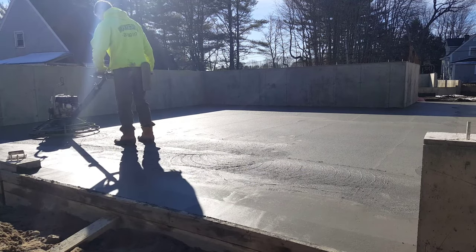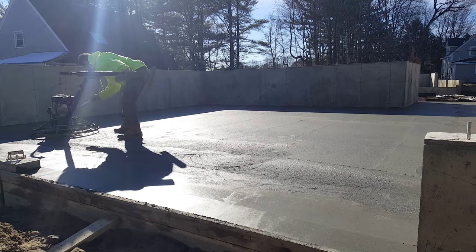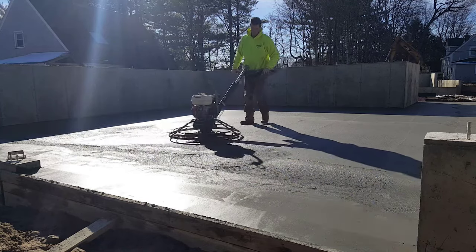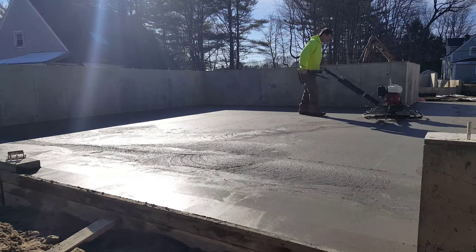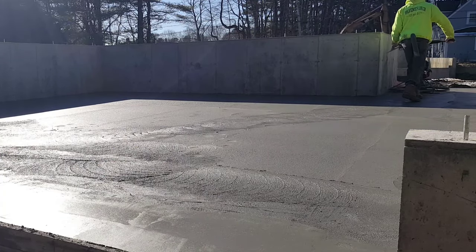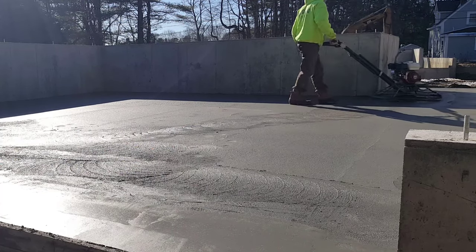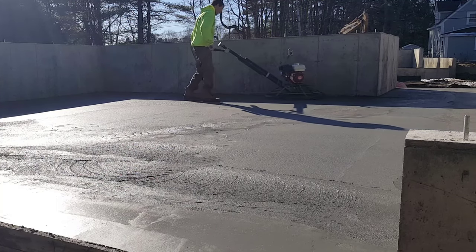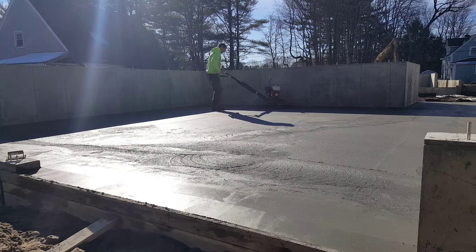I gave it about another 45 minutes, then I got on it again to try it. When I got on it this second time, it had firmed up quite a bit - it felt really good. So on your first pass, we call this a float because we got float blades on. Float blades are these bigger blades that clip on over the finish blade. Some guys use pans when they float like this. Now as you can see as I'm going, I'm not leaving those big thick lines under the power trowel. The first thing I do when I go to finish, when we're inside a foundation like this, is I'll go around my edges and work them up.